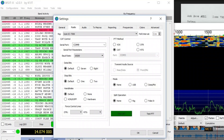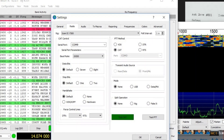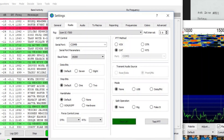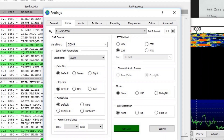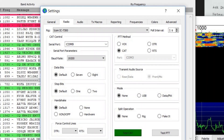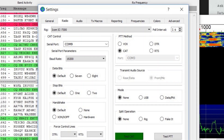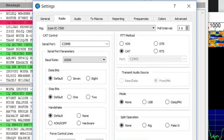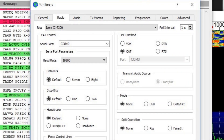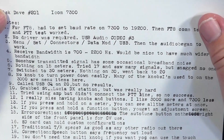For FT8, I brought up WSJT-X — the latest release version that has the new FT8 in it, but not FT4. The first thing I had to do was set up communications with the radio. The computer wanted to do 19,200 baud, but the 7300 was set to auto, which meant the two should have negotiated a bit rate — they did not. So I set the 7300 to 19,200 and it immediately began to work. The FT8 communications test and the push-to-talk test worked.